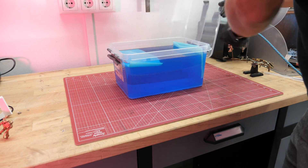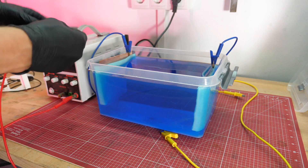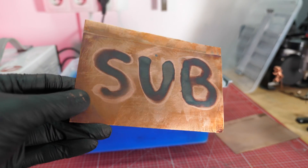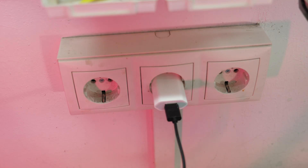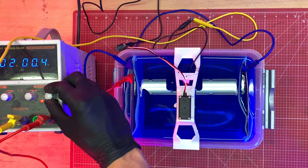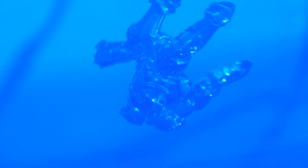Now the fun part begins. We put the print into a copper electrolyte and apply a voltage. For wiring details, I've linked the how-to metal plate video. Remember that your copper anodes should be very clean. Place the 3D print in the copper electrolyte, plug in the rotary jig, and set the voltage. I always use a low voltage between 0.1 and 0.3 volts at the beginning and slowly increase it. The first 30 minutes should not exceed 0.3 volts. It is a fine line between too much electroplating and decomposing the conductive varnish — be careful!